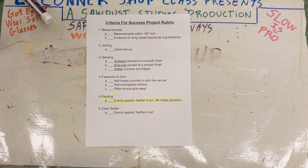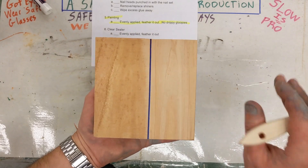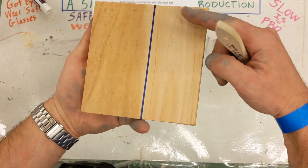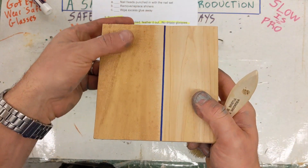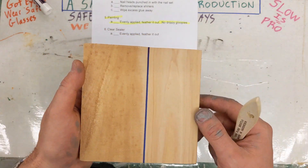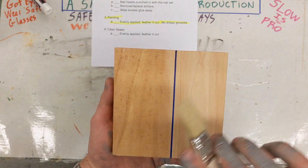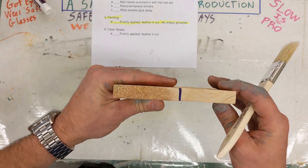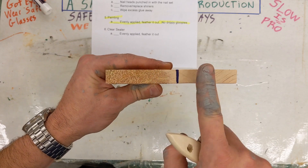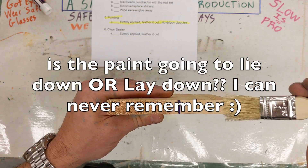To have an evenly applied paint coat, it really all starts with sanding. See the difference — this is lighter, you can kind of tell it's smoother versus the rough cut. All of your surfaces have to be sanded anyway. When you get it down to as smooth as the sandpaper will let you, that will help the coat apply evenly. Look at the end cut — see the fundamental difference between an unsanded end cut and a sanded end cut.